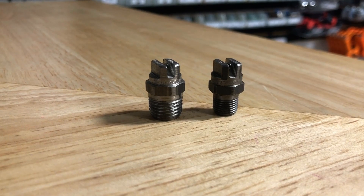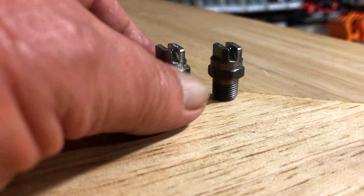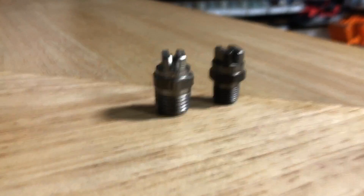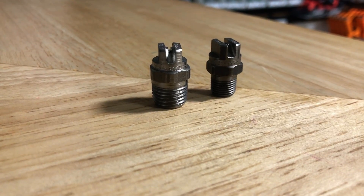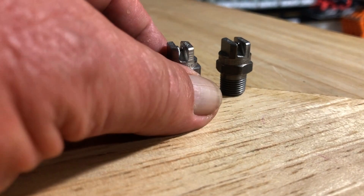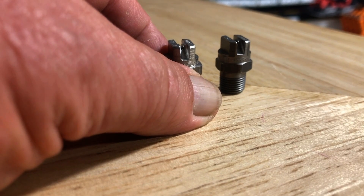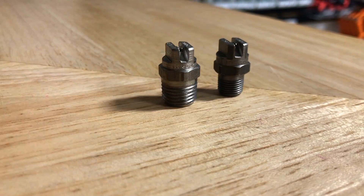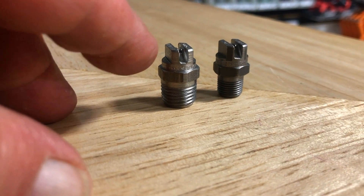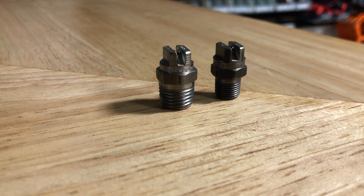You can also use an air compressor to blow them out, but a dental pick or welder's cleaning tip tool from Home Depot or Lowe's works just fine. Look up through toward the light to make sure it's not blocked. Always keep spare nozzles — when you get a clogged nozzle on a job, you'll know because the surface cleaner disc will start vibrating and sometimes leave swirl marks or clean improperly. Just pull the clogged nozzle out, replace it, put the clogged one in a bag, and unclog them all at once during maintenance to save downtime on the job.